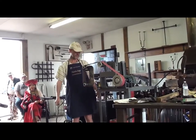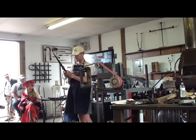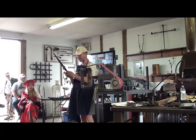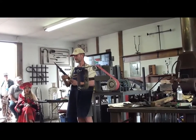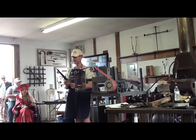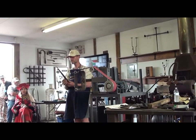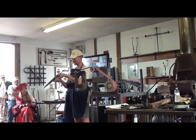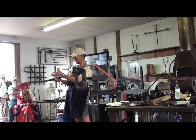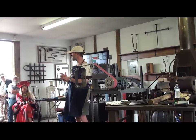I'm going to blend this up to my lines nicely, and then we're going to put on the wheel and I'm going to hollow grind these bevels. Once I start grinding the bevels, I have to check quite regularly, because if there are any undulations in the cutting edge, I've got to grind my edge back to center.